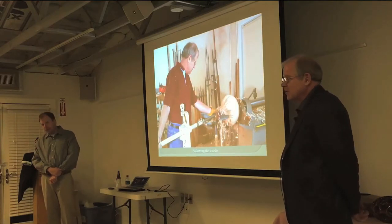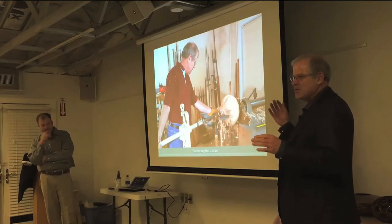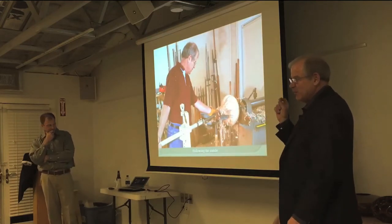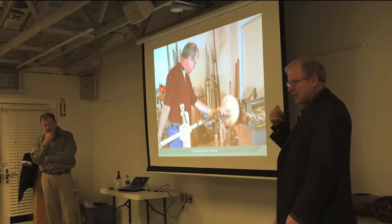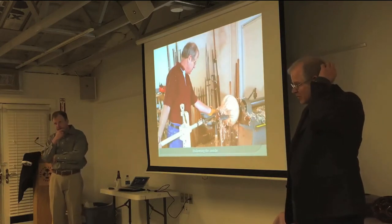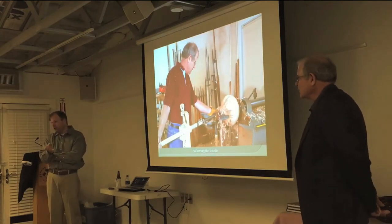Whenever they get dull. Yeah. So with a soft wood, you can maybe do 3 or 4 pieces if you don't get anything bad, but with real hardwood, some woods are abrasive, and they'll start dulling halfway through. You might want to sharpen it because you can just tell it's not cutting. It depends, and some woods have silica. I mean, there's a density to woods.